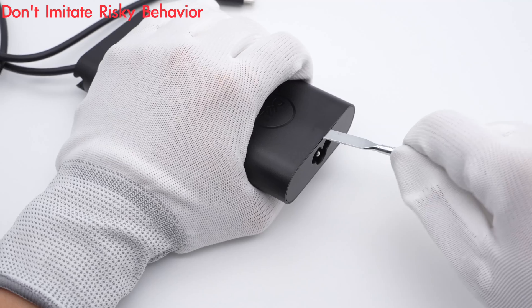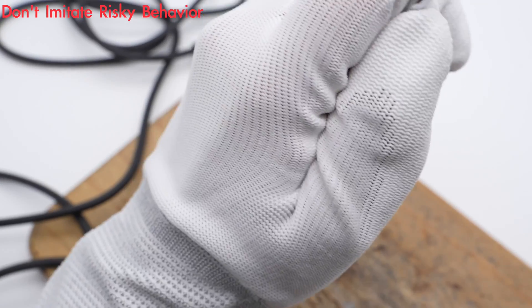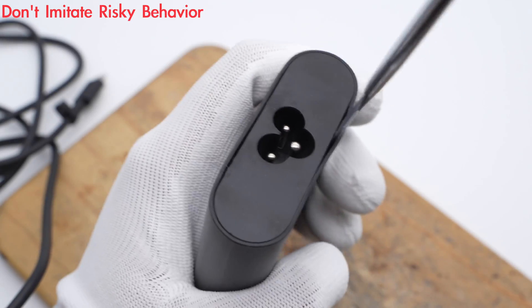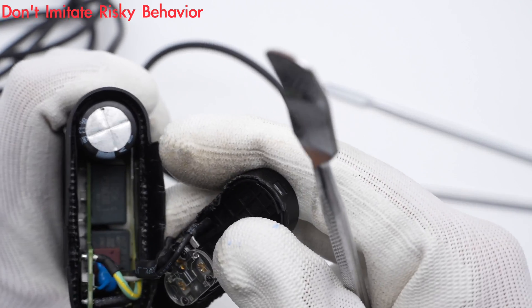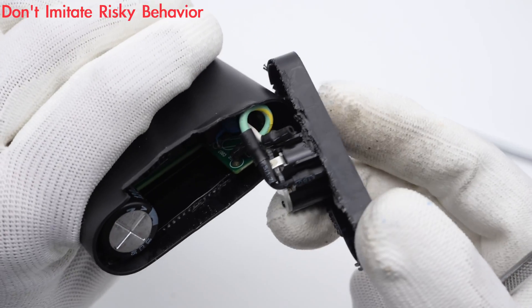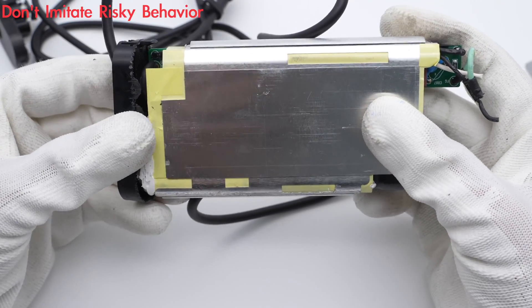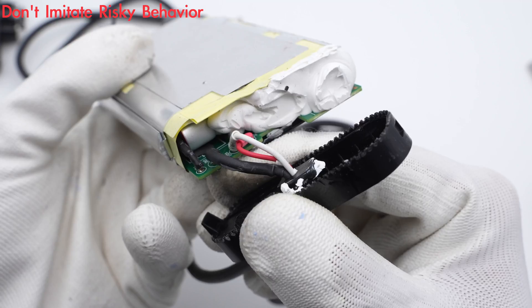Let's start to take it apart. Using a spudger and hammer to pry off the cover of the input end. The transparent plastic plate is used to insulate the socket, and the solder joints are insulated by heat shrinkable tubing. Continuing to remove the output end and cutting off the input wires, we pull out the PCBA module. The PCBA module is wrapped with aluminum plates, which can enhance the heat dissipation performance. The upper wires are soldered to the PCBA and insulated by heat shrinkable tubing; the input wires adopt the same design.